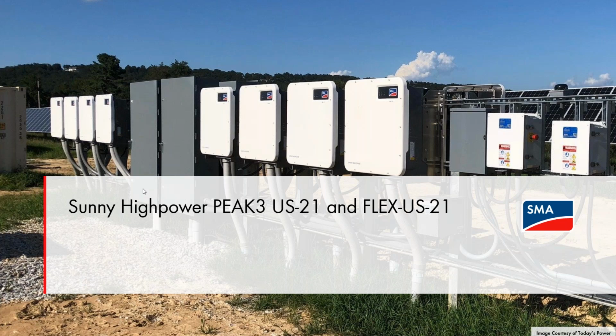Great. And somebody's asking, what is the SB listing about? Oh, that is the topic for a whole other webinar. The SB listing is, there has been an update to the documents kind of detailing all of the functionality that must be provided by grid interactive inverters. The IEEE 1547 document was updated in 2018, modified again slightly in 2020. The testing document 1547.1 was updated in 2020.